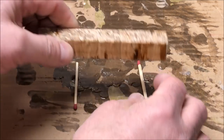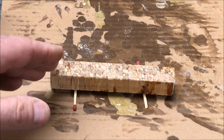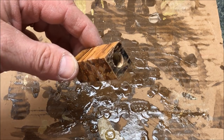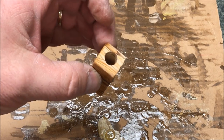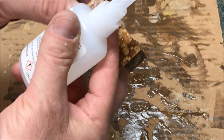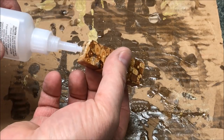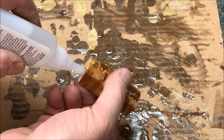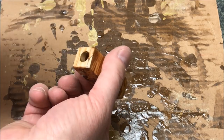What we're going to do now is the same exact thing on the opposite side of the blank. I've got my blank cut to the proper size and I've gone ahead and put a 27/64 hole right down the middle. What I'm going to do to hopefully help with this blank is drool CA glue right down the inside of the blank.